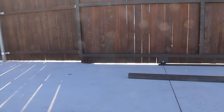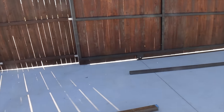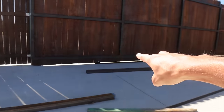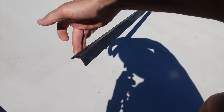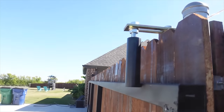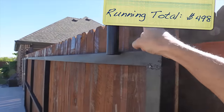We need to go here on our little DIY custom pad, which seems to be working out pretty well. These planks are all different lengths — you would think when you buy them perfectly lined up across the top, the bottom would be the same way, but it's not, and it's causing these to drag quite a bit. It is going to self-clearance over time; I might just take a saw and rip the bottom all the way across. We're going to get about five feet cut off of this one-eighth by one-inch piece of metal — our little V-track that our caster wheels run on. We also have our roller guides now mounted up; those roll nicely across the track — about $30 off Amazon on sale.